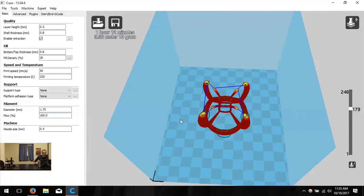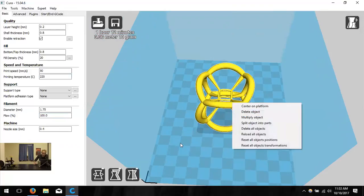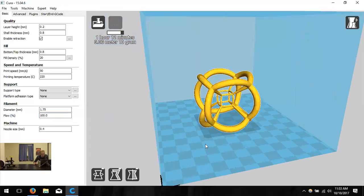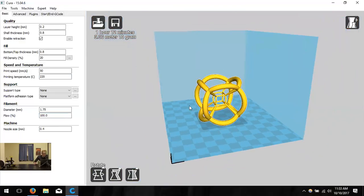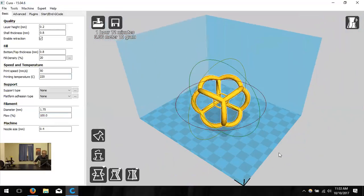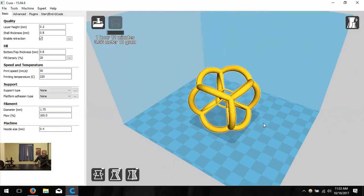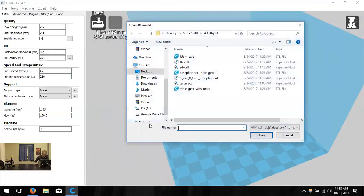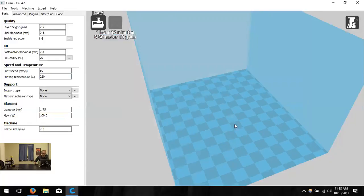Print orientation is an important concept. In the interface, right-click to rotate the camera view, right-click drag to pan, and scroll to zoom in and out. There's also a Rotate tool that shows three axes and snaps to 15-degree increments. Print orientation means deciding the best way to position your model for printing. I'll load a shampoo lid I designed in Fusion 360 to demonstrate.